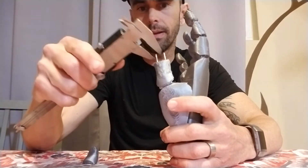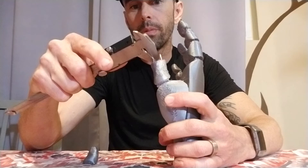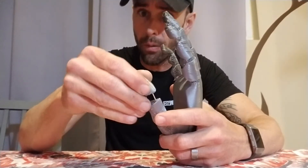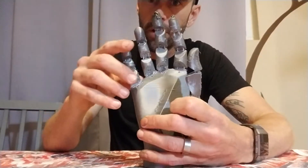The hand is held together with wire that you can get from a hardware store. It is 1.6 millimeters in diameter — I'd tell you the gauge but I can't remember; if I do I'll put it in the description. You could maybe go thinner but you can't really go thicker than 1.6mm. If you print this on a good setting the wire will feed in really nicely — it's snug but it still feeds in. There are two wires in each finger to keep it from flexing in bizarre ways.